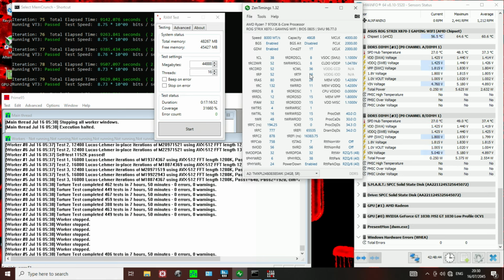But for comparison, I was not having that level of success with the Hero. The Tomahawk just straight up doesn't like 7000 series CPUs at all. The Tomahawk at 8000 is really weird, because with the 9000 series chips it plays really nicely, but with 7000 series it really doesn't. There are some major differences in how that BIOS is set up for 9000 series compared to 7000 series. So the ITX Strix just seemed to be the most promising of the boards, and that's why I stuck the 9700X in here. Funnily enough, the Strix seems to really not like Hynix 16 gigabit ADI.